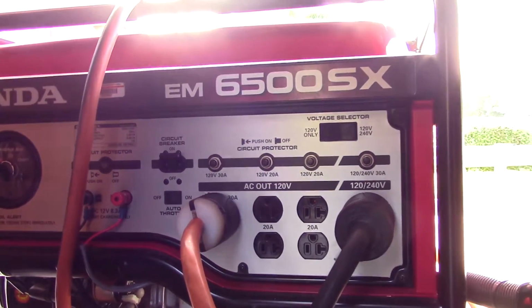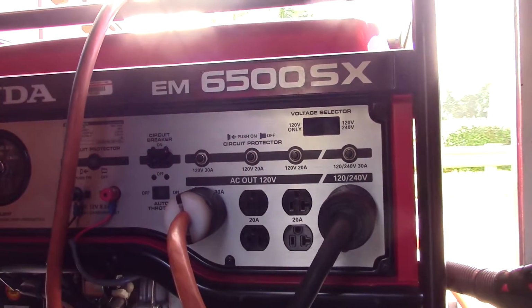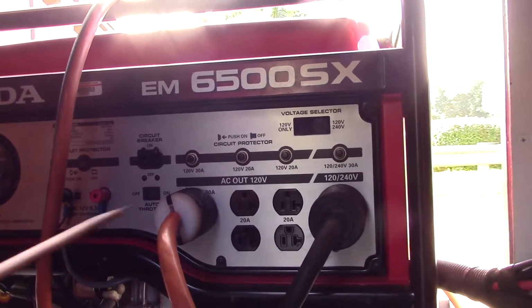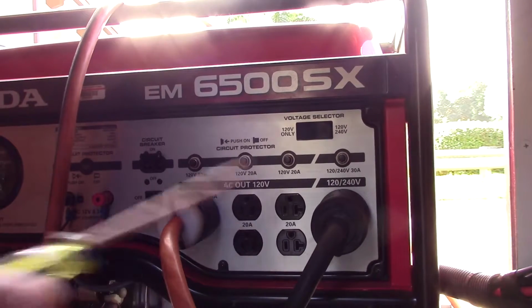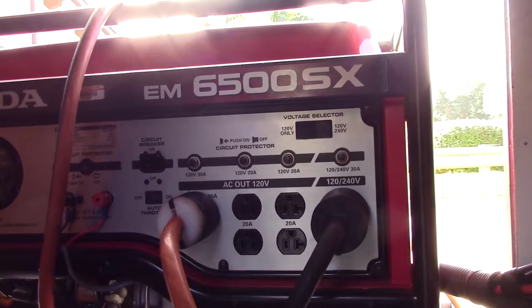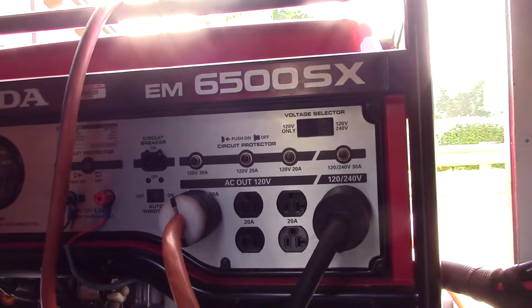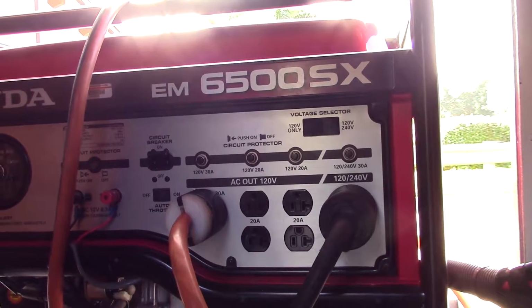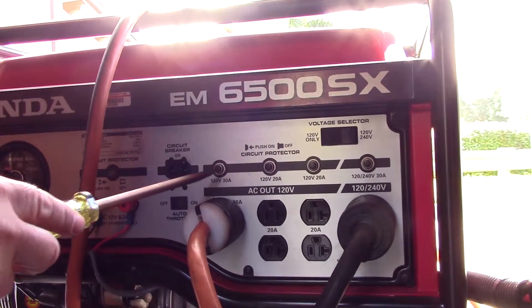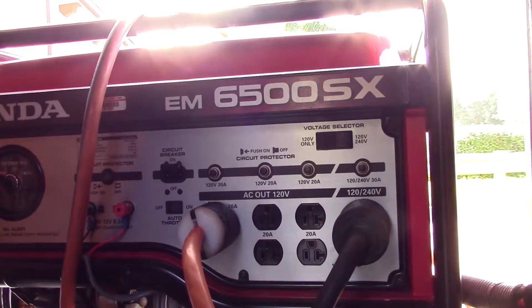If for any reason you need additional power that the truck can't handle, you would use these two receptacles here for 110 regular power. This generator supplies 30 amp, 240 volts to 2, and two 120 20 amps that this generator can output. So you have plenty of power in order to add more lighting to the scene for dressing and whatever the scene calls for at that time. As I said, a quick review: the main circuit breaker, individual circuit breakers in the up position for on, pushed in for on, and continue your operations from there.